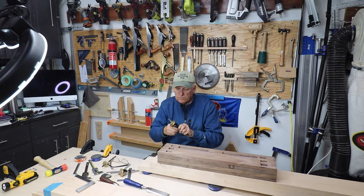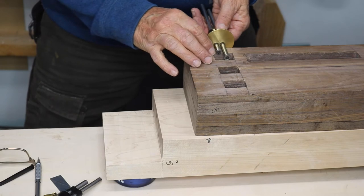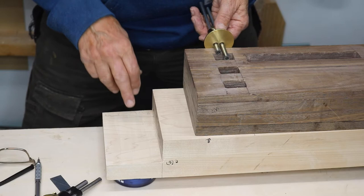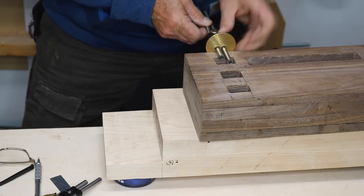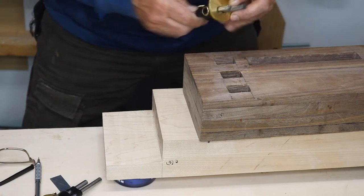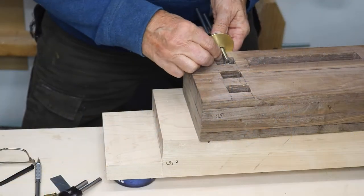What I want to do is loosen everything. I make sure I'm referencing the top of this end piece and then referencing the top of my apron. I just take this rod here and move it till it pulls right back — you can feel it engaged on the edge because it's got a little raised ridge, so it runs along that bar and catches the edge of your mortise.